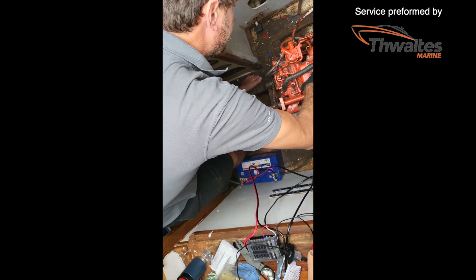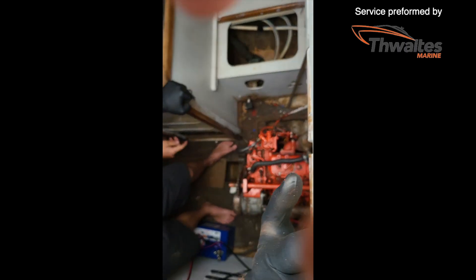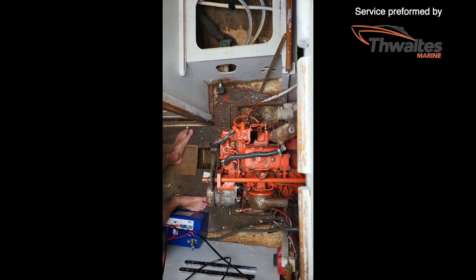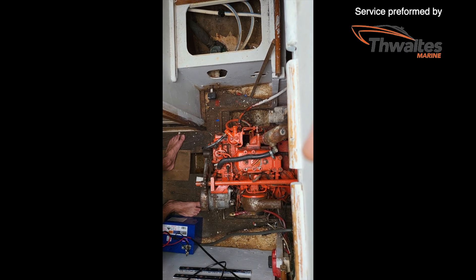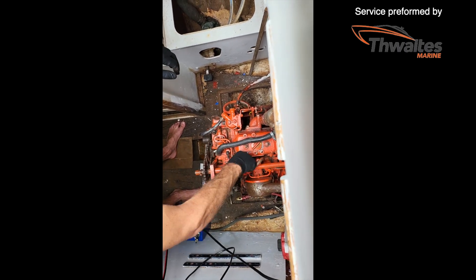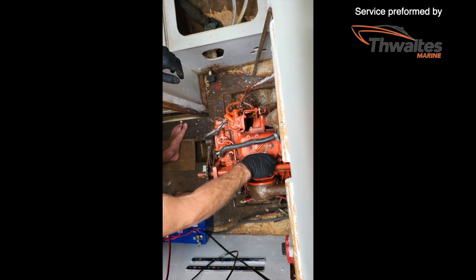I think we'll spin it over if the decompression is open for a start, and then we can see the other hose. I'll flick them back. Where's the decompression lever? These here, so I just want to flick it over, make sure there's no water in it or anything — if I do that it'll be a lot harder for it to crank over.